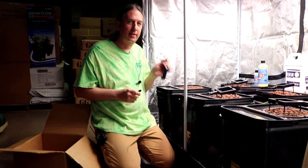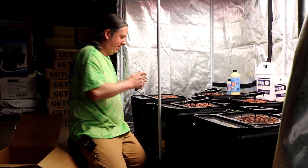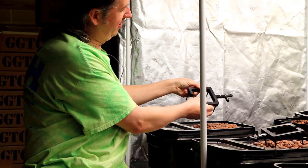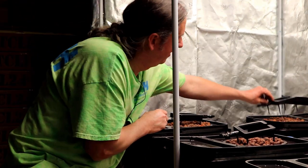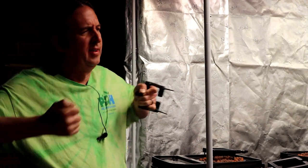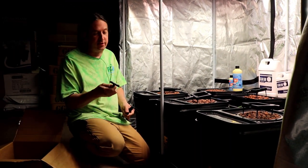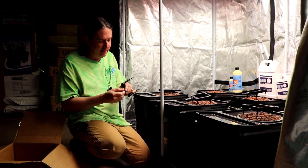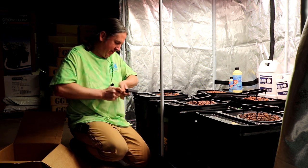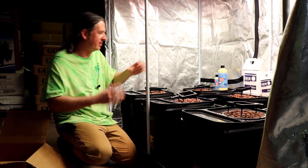The end ones here I'm going to put in a different direction — kind of going like this, that way I can shoot over to the next one. So it looks a little goofy, but when I set it down over here it's going to line right up with that one. I did make some changes in the past year with a lot of stuff, like these parts — this is Hydroflow brand on this half inch, and they're just constructed a lot better. They don't have what's called the flash, which is little ridges coming out. They seem to not leak as bad.